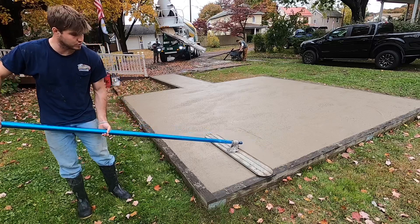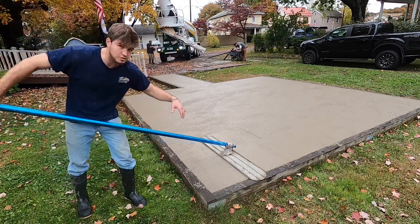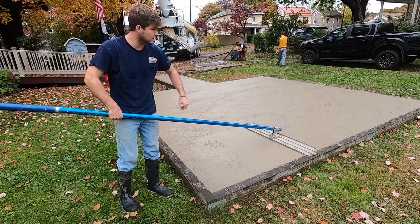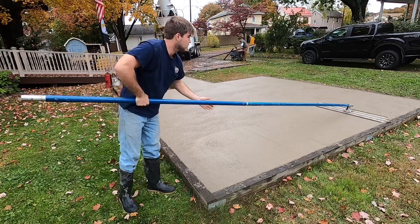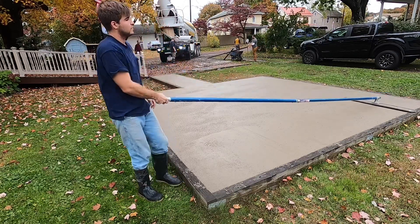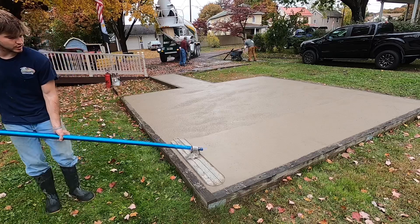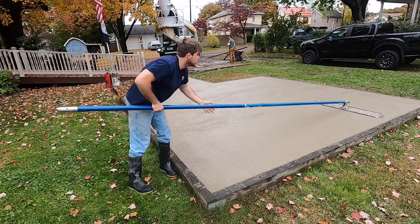You just want whatever way you're pulling, you want that side up. So again, stay away from your edges because you will create dips. So I can ride this edge because it's flat there. So we go all the way across, we stop right there. Back and forth, so all the holes are filled. You can just slightly move over so they're all filled.